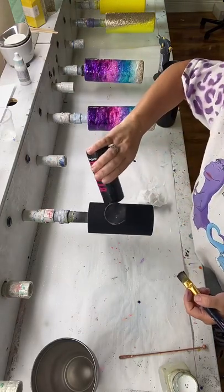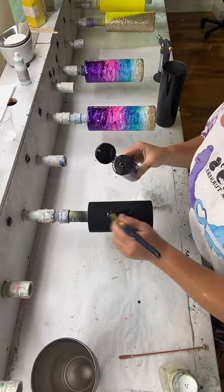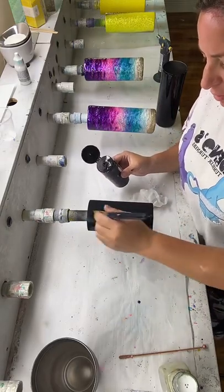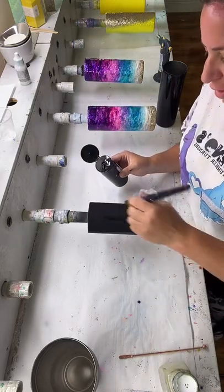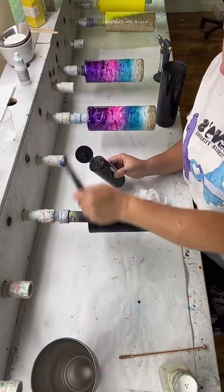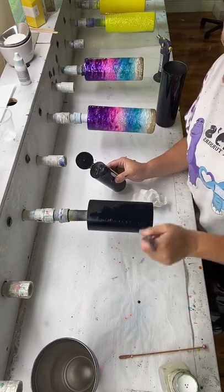I'm gonna do another coat. And like I said, all the streaks go away. All of the streaks completely go away under epoxy. I always make sure that it's a good even coat. If you see streaks and you can see a lighter color black between the streaks, then I will go with another layer. But as far as it being streaky from my paintbrush, I've left them like that, and I haven't had an issue once epoxy hit it.